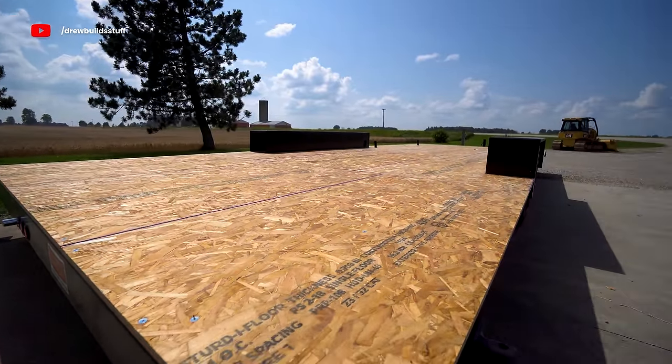Then these are going to screw into another piece of 6x6 that extends up vertically to support the ridge beam. So I marked out some bolt holes and drilled them through with a 1/4-inch long drill bit. And then used a 1.5-inch Forstner bit to make some countersinks. As you can hear, it was incredibly windy this day, as it was a lot of days out in the middle of this field, which made this process so much easier.